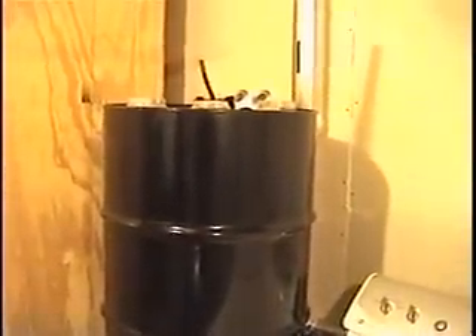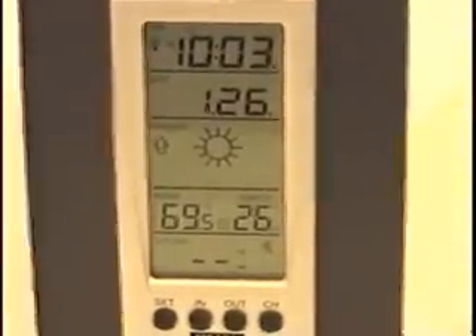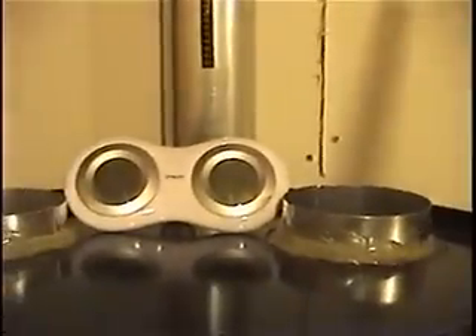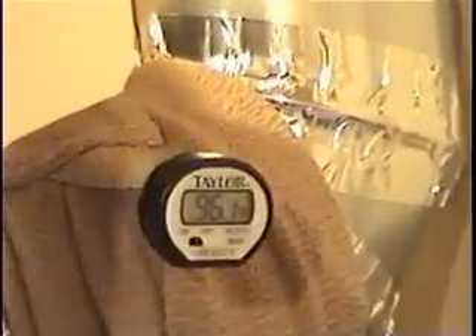You're starting to hear a little squeaking from that idler pulley — that's been a problem. At one hour and 45 minutes, room temperature is 69.5 degrees. Air through the tube temperature is 72 degrees. Top of drum temperature is 79 degrees. Outlet temperature is 96.1 degrees and inlet temperature is 80 degrees.